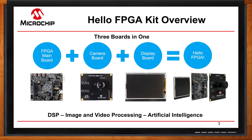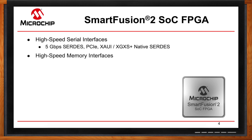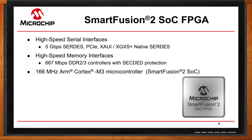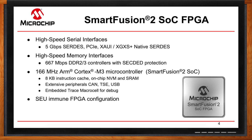Tell me more about this SmartFusion 2 FPGA inside. The SmartFusion 2 is part of our Generation 4, which we consider low-density FPGAs but with more resources. Those resources come in the form of high-speed serial interfaces with 5-gigabit SerDes, and high-speed memory interfaces with DDR2 and DDR3 controllers. We've also added an ARM Cortex-M3 hard-embedded processor into the SmartFusion 2 SoC to help with processing capabilities.